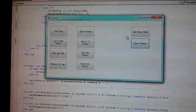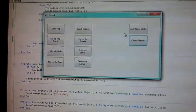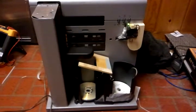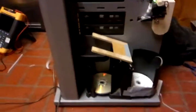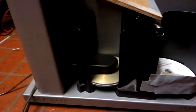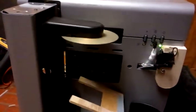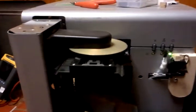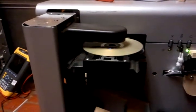You can see it here — it's a simple temp one, but I'm going to be getting rid of this and putting in a more permanent burning program at some point. If you hit the get new disk button over here, it goes down, grabs the disk. See the little pause there — that was the Arduino checking the sensor. It goes up here, the servo hits the eject button and it drops down again.